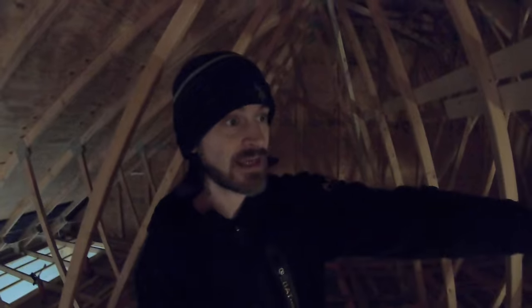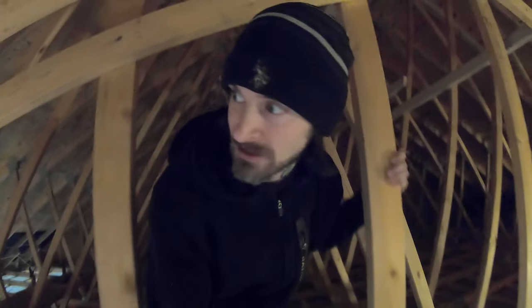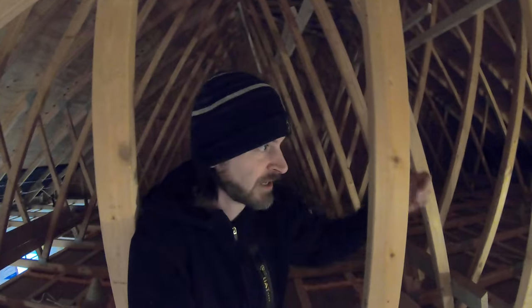And then lastly, they can go ahead and spray these scissor trusses, because that's actually my biggest concern about getting insulation and air sealing when we're dealing with these corners over here, or these where it tapers to a real sharp point, as opposed to a lot of room over here where the eaves are with the flat common trusses.